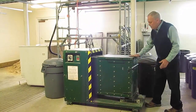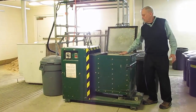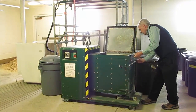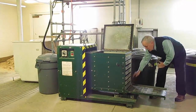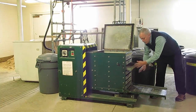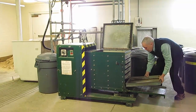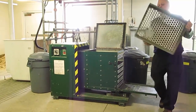What it has is a large tray here where I can put sample. It calls for two and a half gallons of as-fed material. I basically have a series of screens here. They go all the way from a very large screen down to smaller and smaller sizes, all the way to having a 1.18 millimeter screen, and then a pan on the bottom.